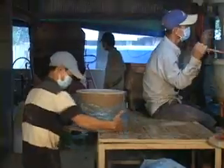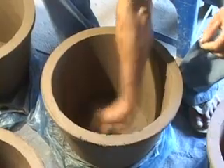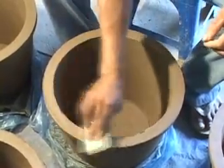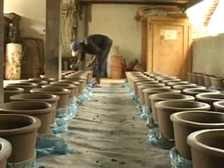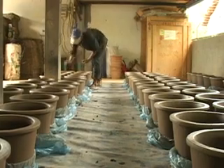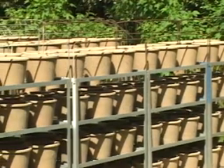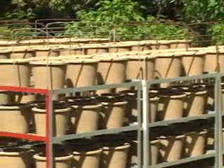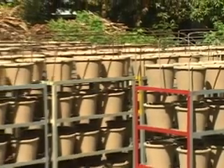The filters are carefully removed from the press and placed on the floor in a drying area to begin hardening. The filters are left undisturbed in the hardening area for several hours. At this point, workers shape up the filters and use simple punches to press in the manufacturing date, manufacturer's name, and a special number. This information can be put into a database to allow tracking of the filter throughout its lifespan. Filters remain in the hardening area until the next day, when they are loaded onto color-coded drying racks and moved out to a drying pad using a jack dolly.